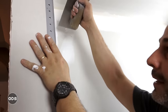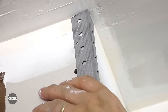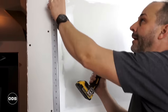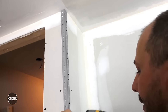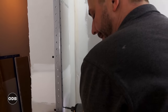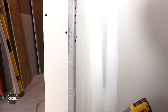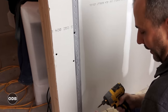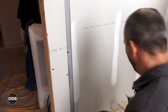We're going to push it up to the ceiling. I've got a gap here and a gap here to fill. When you're doing outside corner beads, you're going to have a pretty significant gap, and that's a good thing. Because we bent the metal and created a nice gap, we can use drywall screws. There is a blue ring drywall nail on the market — it's a thin metal with a flat head and you can pound them in, it does a great job — but I would rather use screws to get a good grab. I don't have to rely on adhesives or something mechanical that busts through the metal into the drywall. You don't have to put a screw in every single hole — every 16 to 24 inches is plenty, as long as you have a nice tight corner.